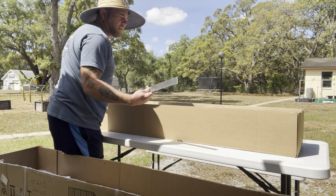A quick tip to make assembly go a little bit quicker: you're going to have these frame pieces for the interior, which go across the insides of the wall panels. If you go ahead and put all those together first, it's going to save you a lot of time. I've found it's much easier to put a full wall together with the frame pieces on the bottom, then stand it up and screw everything together. You can do the back wall and both side walls completely ready — assembly will be much quicker because you won't have as many pieces flopping around on you.